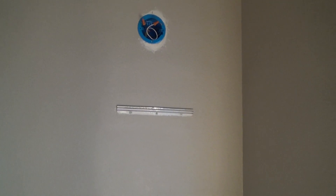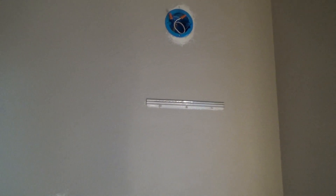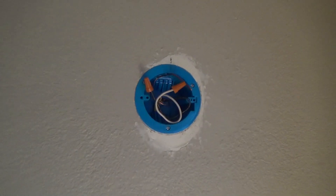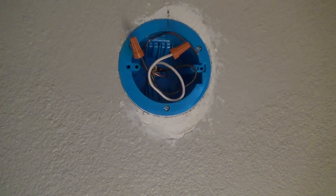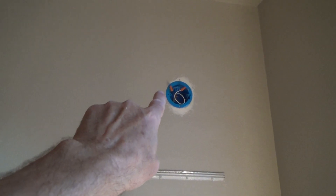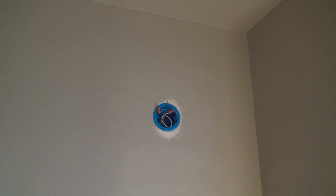Another good reason to go ahead and take your light fixture down before you paint. It doesn't take that long to do that. Incidentally, before I installed that light fixture from before, there was a big old hole here and nothing — the wires just came out of the wall in about a two-inch hole. So I ended up getting a cut-in box and installing that.